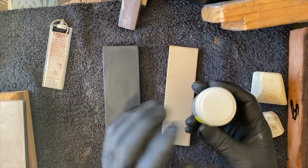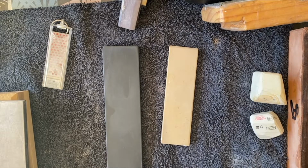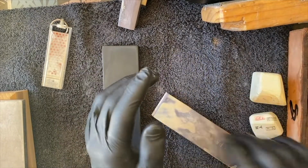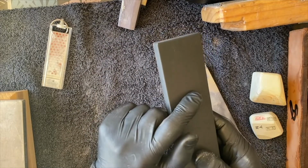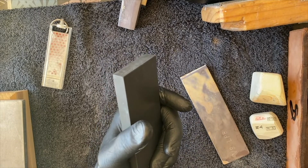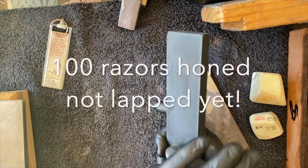This is silicon carbide. This is a powder. You throw this on a piece of floating glass, and that's the abrasive. You add a little bit of water on it, and you can also lap your stones with it. It's actually a very good way of lapping very hard stones that take a lot of time up, like Arkansas. You can use silicon carbide. So these abrasives are one of the biggest industries in the world because we keep digging and cutting and doing things. So we understand as a human species abrasives quite well, and they're across the board.